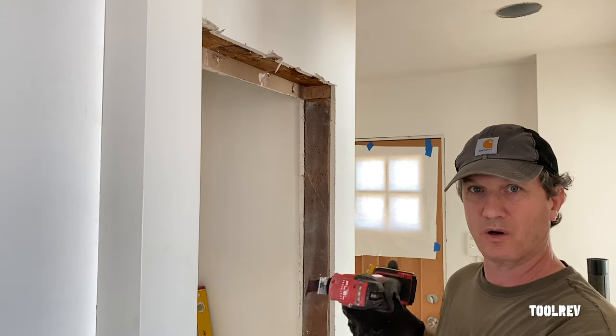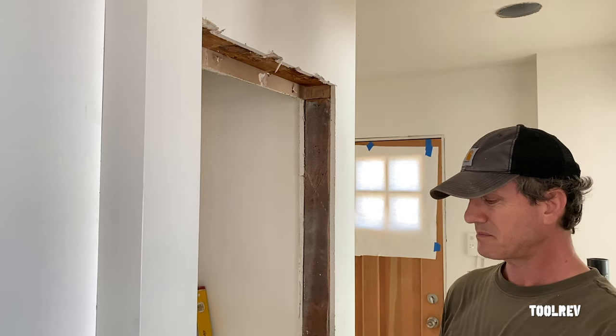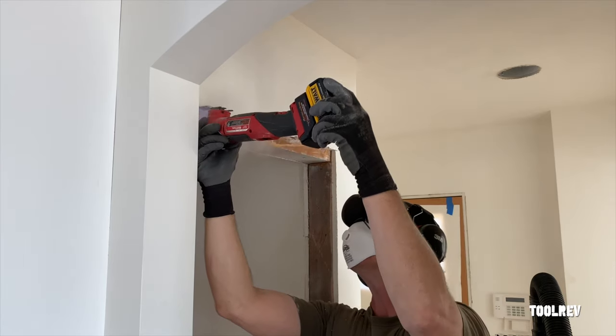The blade's pretty wild if you start a cut on 10. So if you're trying to cut a straight line in some flooring or notching something out, you want to start on auto, and then get rolling — but sometimes this jumps out of auto to 10 abruptly instead of ramping up slowly. I've had three of these in my possession that I've tried, and they all did the same thing.